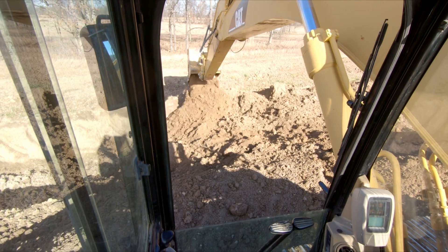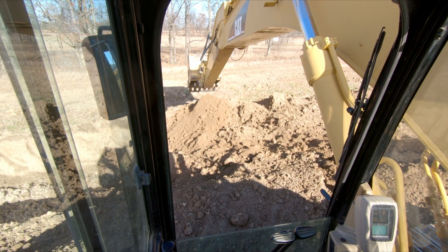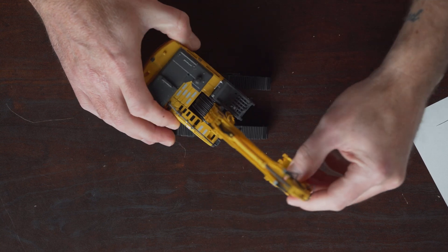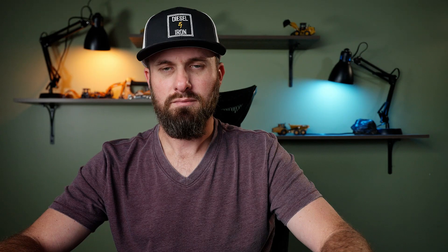There's a reason I wanted to demonstrate this with die-cast — if I was out there just slamming myself around in an excavator it's not great for the equipment. I can do this in a very controlled way; in real time this happens much quicker. So we've got our load up, we start sticking out, we boom down at the same time — we tip a little bit, but look at how gently we set back down. We didn't slam back down. Essentially: load your bucket, get it heaped, boom up to give yourself room, and then as you stick out you're booming down, and at the very last second throw your bucket. That's what keeps you stable.